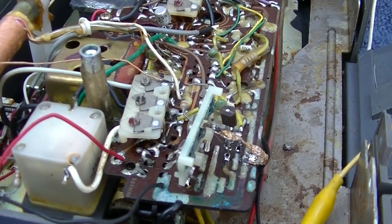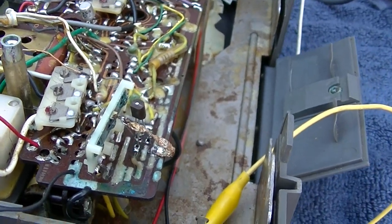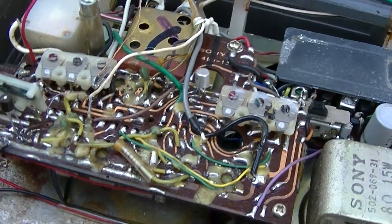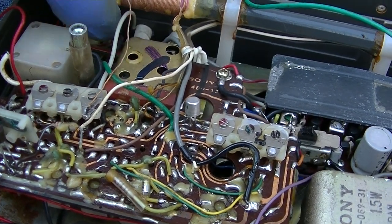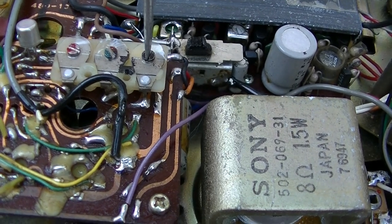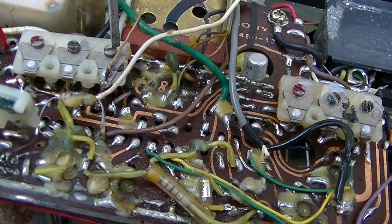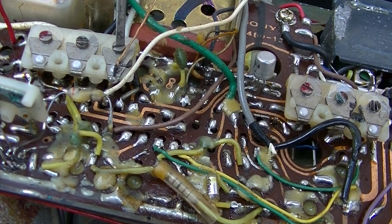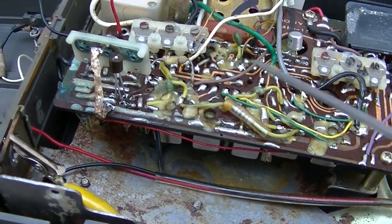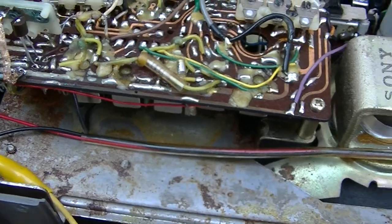This is a KT368 — a Russian 900 MHz transistor — and this one sounds clean. If you turn it to its null point it just overloads there. These converter transistors are very picky. These are the front end, so every time you change the transistor you move the spot on the dial a little bit. That one almost sounds decent, like tolerable.